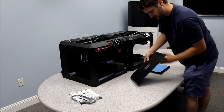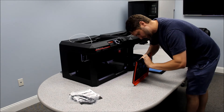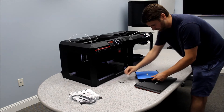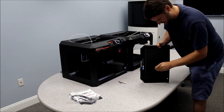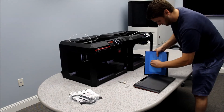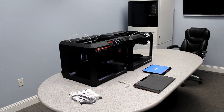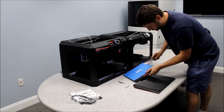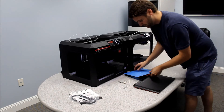I'll flex the tray to try to get this part off. The part itself comes off easily on both of them, but by flexing I can get my finger under and pop it off the Replicator Plus, whereas with the 5th gen I have to get my wood chisel out to get under it and peel it off. It's not too big of a deal, but definitely easier having the ability to flex the tray.